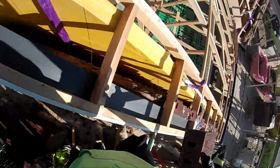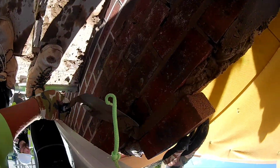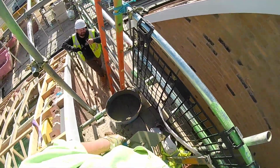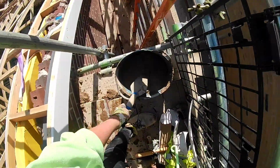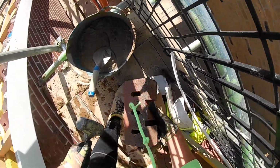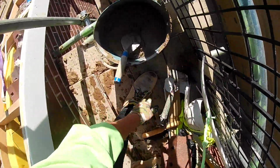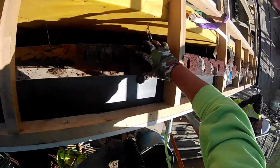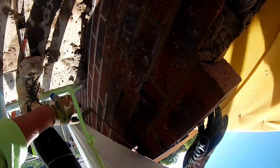A bloke called Coolen Brickworks, I've seen this video before where he uses some spring clips. They look a little bit like jump lead clips that you use on your car, if you want some reference. You clamp them over the fascia and soffit. He uses 25 mm spring clips. Obviously, I ordered some Roughneck ones, which is the same as he was using. I presume you can use any spring clips that are 25 mil, I think they grip to the width of 25 mil, and the reason you have them as small as possible is so they have the maximum tension and grip.